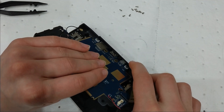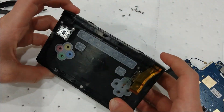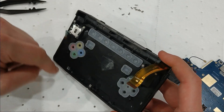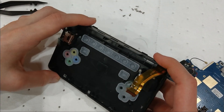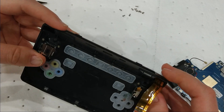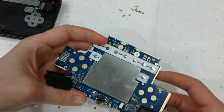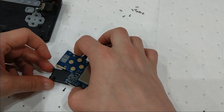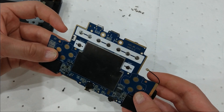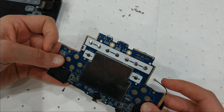And there we go. Here you can see the plain shell. There's what looks like a magnet for the screen, and we've got silicone pads — I think those are the same pads used in the Revo K101, possibly. Let's see what's on the other side of the motherboard. This is the H55 motherboard version 3.0. There's a connector here that wasn't used for anything — I wonder what that connector's for.